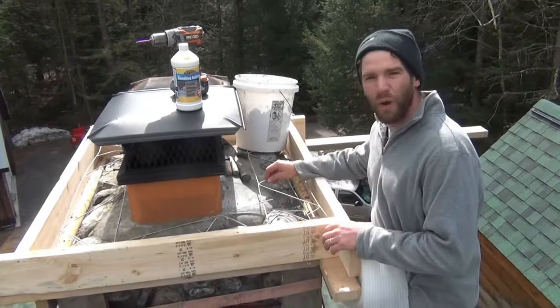This chimney took seven bags of 80-pound QuickCrete. It's roughly four feet by three and a half feet. If you had to rebuild the top course of stone, leave it concaved in a bit and let the cap concrete fill that back concave and out over — that gives it a lot more strength. The cap is really essential. A lot of masons, especially years ago, just smeared leftover mortar on top and called it a cap. But not only does it keep water away, it also creates the heavy thing that holds the whole chimney together. Having something that weighs 500 pounds on top actually helps bind the whole thing together through friction.